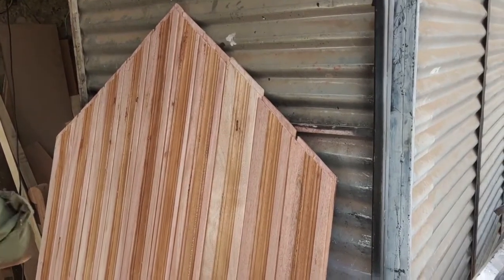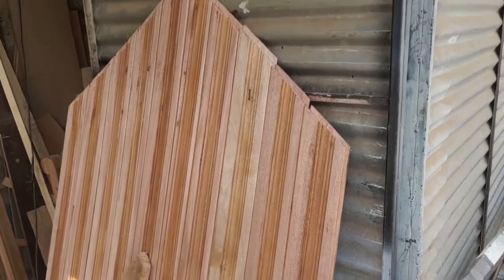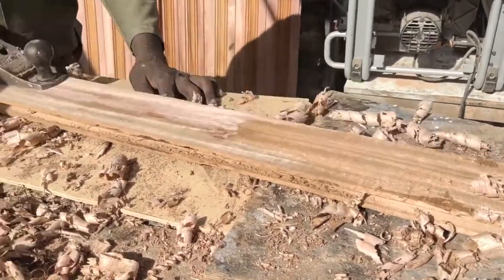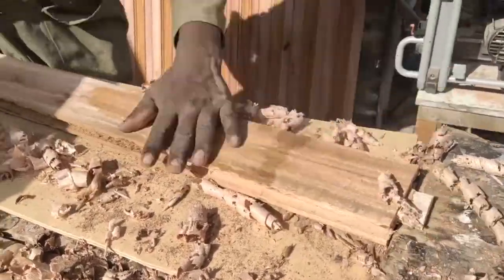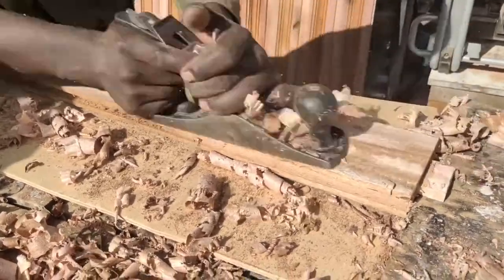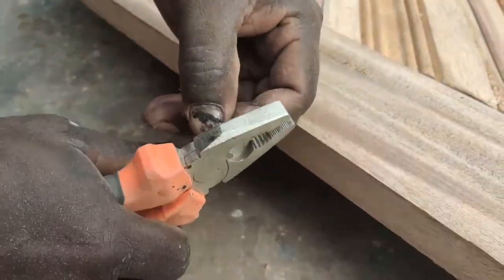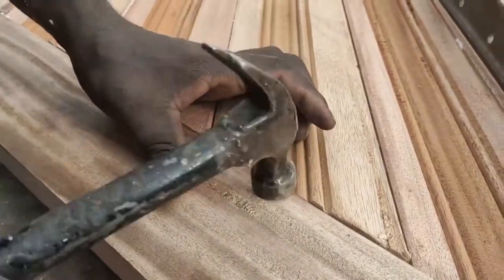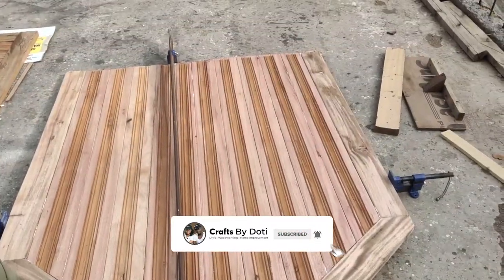Once we were done we worked on the middle part, then progressed to work on the third part. After all the dry fitting was done for the three parts, we dismantled everything and planed down all the pieces. After all the planing was done, we used wood glue and 1-inch nails, which we reduced by cutting the nail heads using pliers so that each nail measured 3-quarter inch.